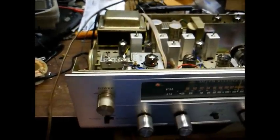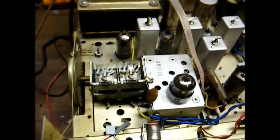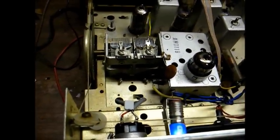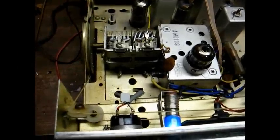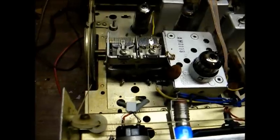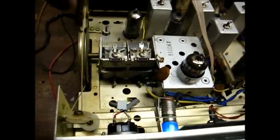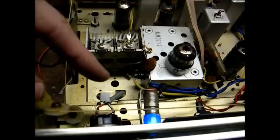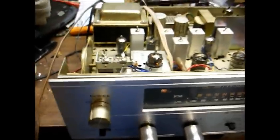He made me promise not to make fun of his switch, so we won't make fun of it. The only thing I was able to find was a standard combination potentiometer and power switch, so I just have it installed here — the potentiometer section is not used. This capacitor is a .01 microfarad cap wired across the switch; its purpose is for noise and arc suppression.